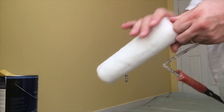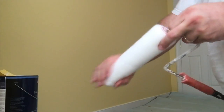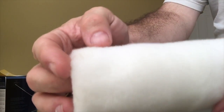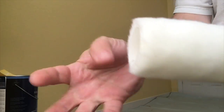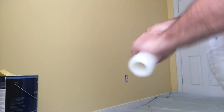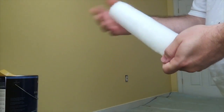Let's get started. I'll take a look at the roller cover I've chosen to use here. I prefer a Purdy quarter inch to half inch nap — this here is a 3/8 inch nap. What I like to do is remove any and all of the excess fuzz from the roller. This will help you avoid getting imperfections in your paint and having to scrape sections off and repaint. This is a step I always take before I start painting.